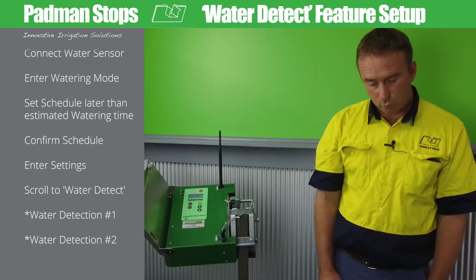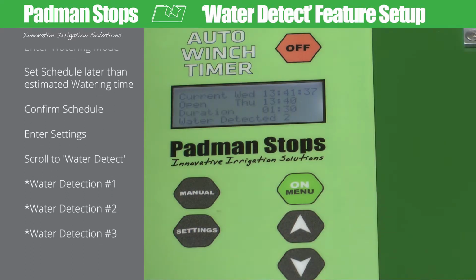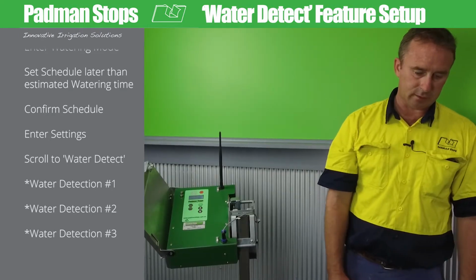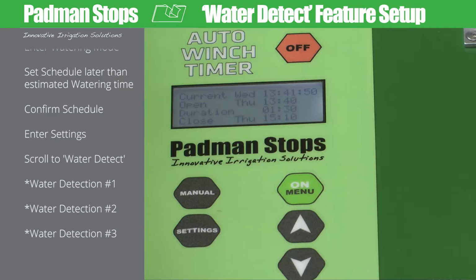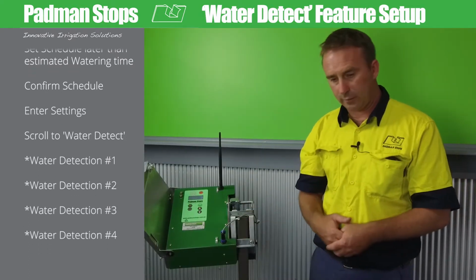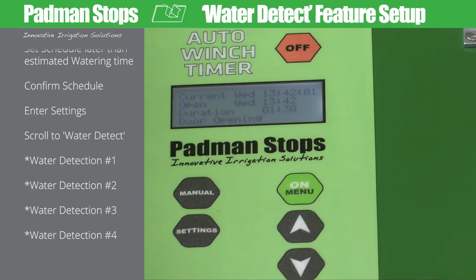If it doesn't detect water, the AutoWinch will obviously go off anyway on the schedule that you've set. So the time schedule that you've put in there is a backup to the water detect. In a sense, you can use it like that, or you can set it so far into the future that it will never open unless there's water detected.